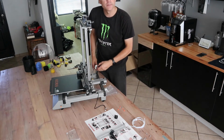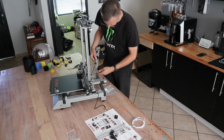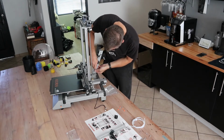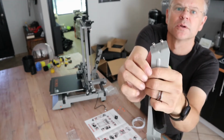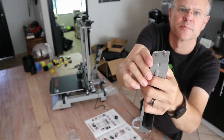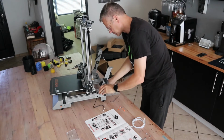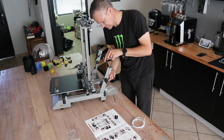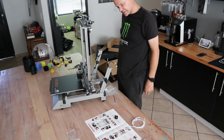So here's a top tip. You can actually install the nuts onto the bolts here, because they just slide into the frame and then they twist into place. Makes it slightly easier. Get the nuts onto the Allen bolts and then just insert these into the slides, and they're basically already where they're supposed to be. And then go ahead and install the little cable into the runners here and just clip them back in place, and then they are sort of where they're supposed to be.